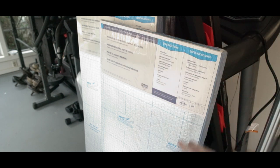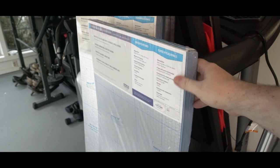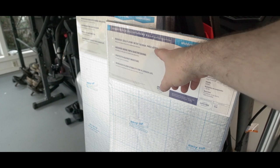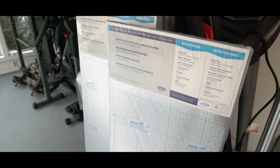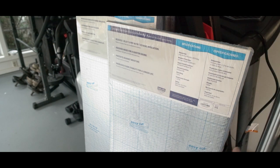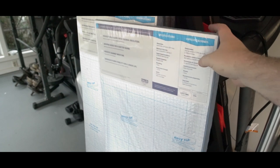We're going to tape these all together once we have them on the floor. This stuff is like a flat, fold-out material — easy to cut, not as complicated as a roll-out barrier. It provides a little bit of thermal insulation and a little bit of sound reduction too, so there's going to be less of that thump when you walk on a hardwood floor. Since the panels already have underlayment built in, we're kind of doubling up. I don't necessarily think that's a good thing — it may flex the floor too much — but this is pretty thin stuff, so I'll have to see over time what it does.